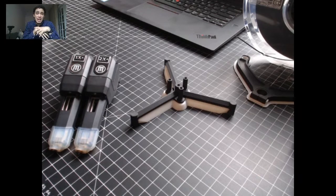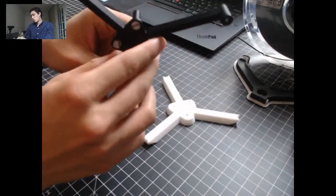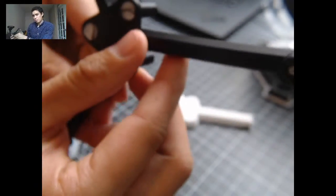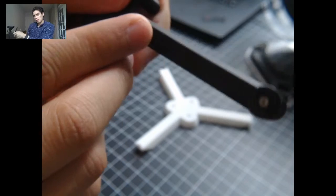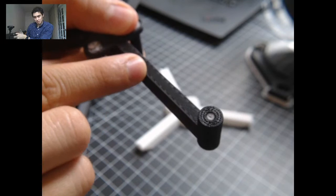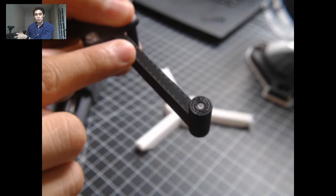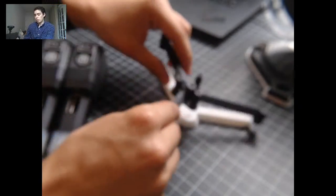That's a nice trick, maybe, but if you go for distances over 20 millimeters, I think it's just not ideal. You really do want to be using supports because that's what's going to guarantee, and in the case of this part you'll see it here immediately, let me bring my macro lens, the proper finish on the part, right? So as you can see here, this part is really, let me bring the light here, super smooth, right? So look at the floors on this part. They're incredibly smooth. There's no way that you'll be able to do that without supports.